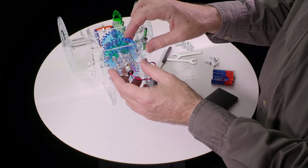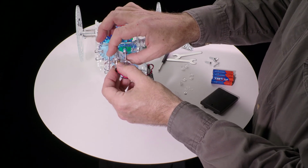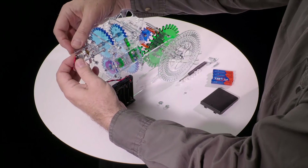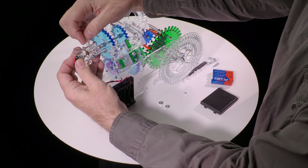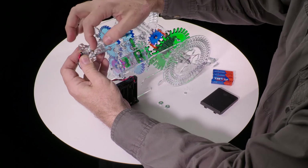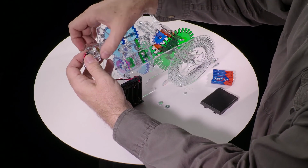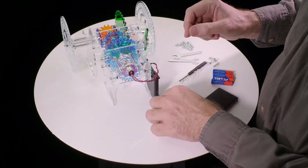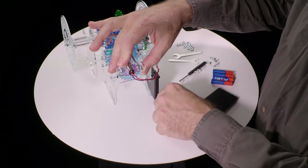You want to sort of push it all the way so that, well, let's see. You want to have it so that when the motor is pushed as far back as it will go in the bracket, there's a bit of a gap there, a couple of millimeters or 1/8 of an inch maybe of gap. Back these nuts up to that point, to the point where there's just sort of a comfortable amount of gap there. It doesn't have to be much. And then put 2 more nuts on the outside.